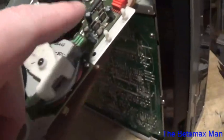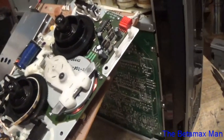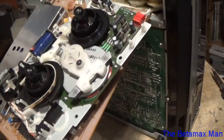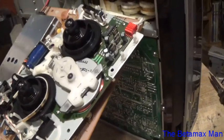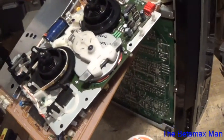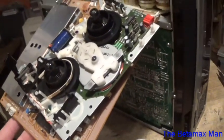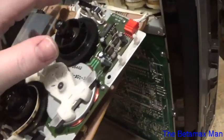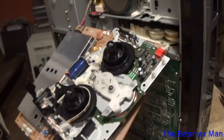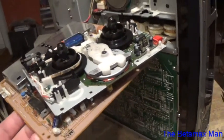Here are all four of the caps. I actually ran out of 16 volt, so I put a 25 volt in — which will be fine; it's a little higher on voltage but it'll work. We've got those in. I hope this motor fixes the problem. So we're going to put this all back in. What I'm worried about is these wires coming out, so I might have to re-solder those just to ensure that's not going to continue to happen.